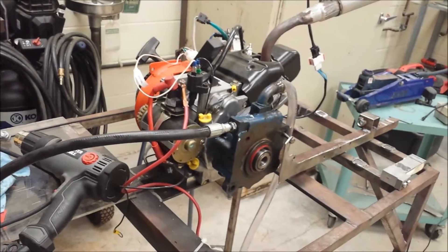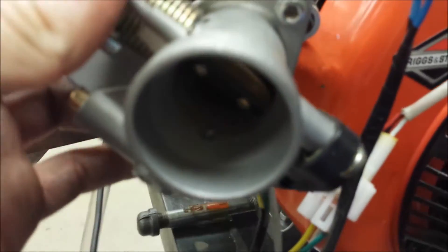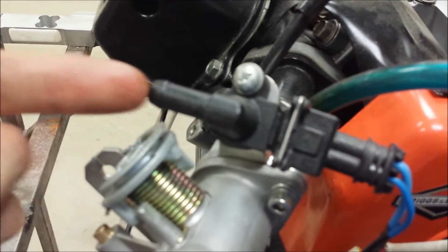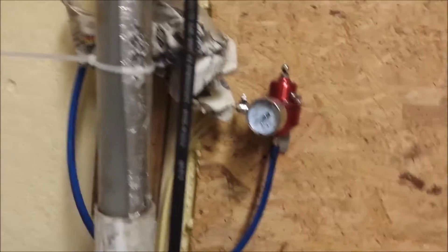I have a couple of microcontrollers just sitting around but we really don't have the time — we're kind of rushing this. This is going to be an ongoing thing; I'm going to be working on this engine for a couple of years. Right now we're on port fuel injection. We have a little throttle body with its own TPS sensor, a MAP sensor, and a fuel injector that mounts underneath — it runs just like a port fuel injected car at about 60 psi fuel pressure, wired up to the ECU. This is all just kind of put together to see if we can get the engine running right.